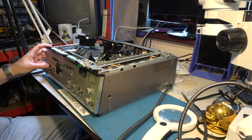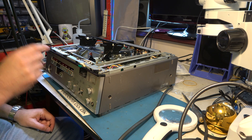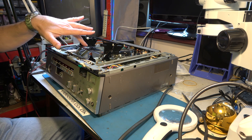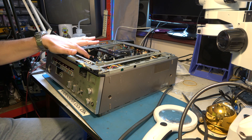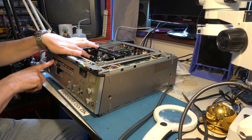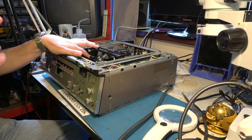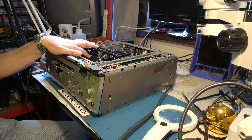Monday the 12th of July, and we have to face the huge disappointment that after fitting the two microswitches, my Betamax video recorder is still not working. If I power it up, the head drum spins and the green light's not coming on — that might mean it's suffering from a dew sensor failure. If I put my finger down as though there's a tape in it, it laces up — that's what it should do — but now nothing else happens. I'm still suspecting a dew sensor error, but I just don't know. I don't have the user manual or the service manual, so I really need some help on this one. I'm going to have to put it to one side until I can get more information on it.